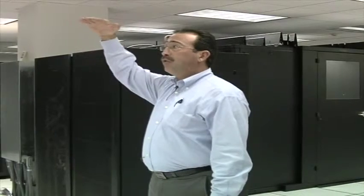So you can imagine it's going to be one white cloud as a curtain on the very high portion of the room closest to the nozzles. As the 10-minute hold time comes into effect, you're going to have descending agent. So the 70 degrees of the room is going to drastically change at the point where the agent is. So if the agent is at 7 feet, it's going to be closest to 0 at 7 feet, but still 70 degrees underneath it.